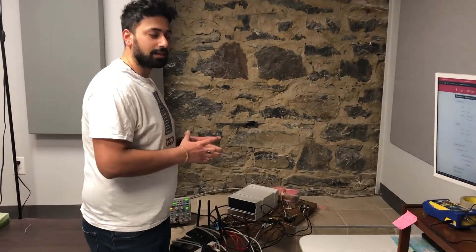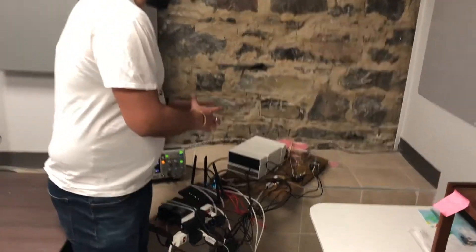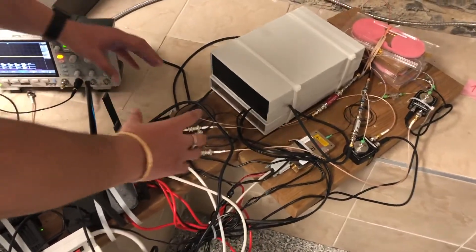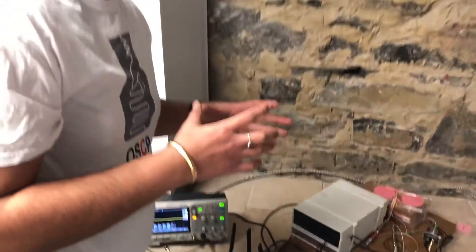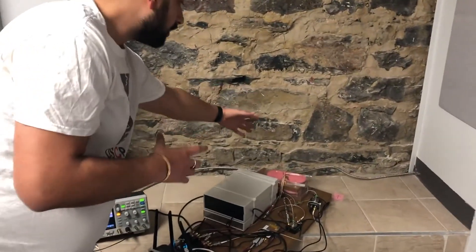I would like to point out that this is our first prototype, and that's why you see all these bulky components. In our next generation prototype, all these electrical components — these two big boxes — are going to be integrated on a PCB of 10 by 10 centimeters. Our optical resonator, which acts as the sensing element of our gyroscope, is going to be integrated on an optical chip of dimension 1 by 1 centimeter.